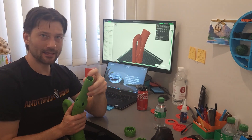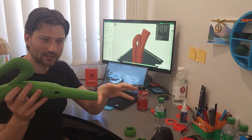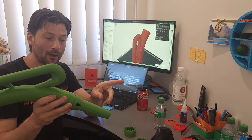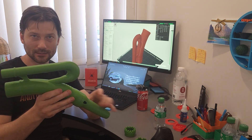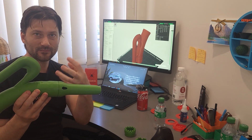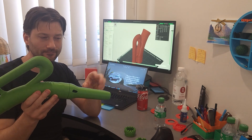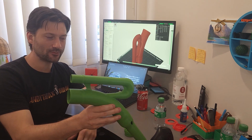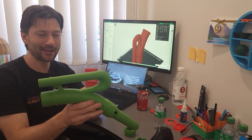The reason you have these holes here is that this intake is 30% the size of the big intake, so all of that suction gets concentrated in one small area to get into those cracks. But then you run into the issue of less water going up the tube because of this restriction, so I added an extra third of surface area via these four precisely-sized holes, and that keeps things moving through the pipe just fine. If you need that little extra bit of suction you just take your hand and cover some of these holes to get all those nuggets out of that crack, then take your hand away and everything flows up nicely.